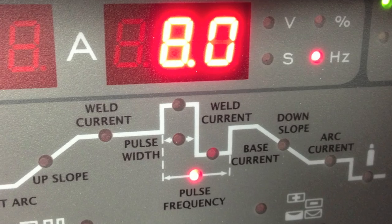There's another look at the finished weld — really good looking welds. I increased the pulse to 8 pulses per second and made another pass, once again centered on the previous bead, making sure to add just enough filler metal so that each bead has roughly the same height on the plate. I'm adding probably anywhere between a sixteenth to an eighth of an inch in thickness with each bead, building up the surface of the plate. Sometimes we have to build it up much more than this, but for this example I just put one pass across the surface, and once again at the end we taper off and add any filler metal needed to avoid a crater or crater cracks.